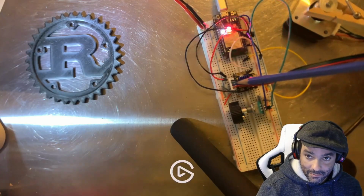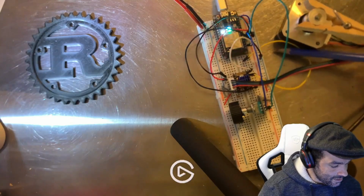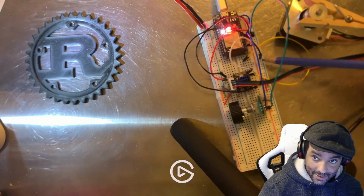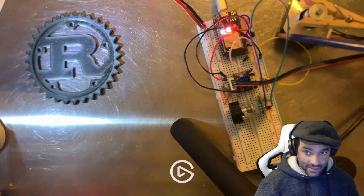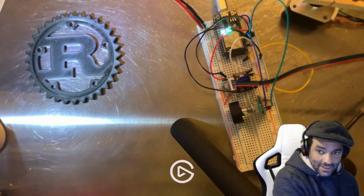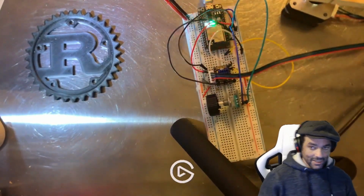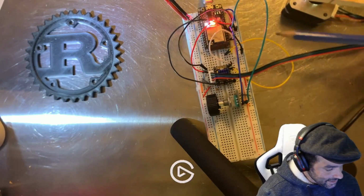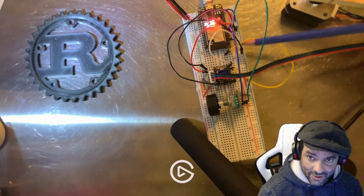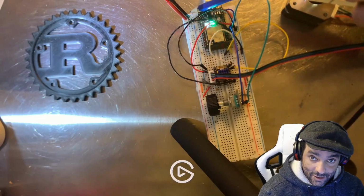This is the motor. That's this one, the same wire. This is the enable, so it's this wire that goes all the way here, and it goes to the... I'm kind of in the way. Well, let's move it a little bit. No, it's fine. So yeah, it goes to the minus of the logic voltage. So this rail, the plus and the minus are for the logic, and this one is for the motor.